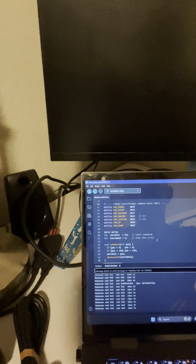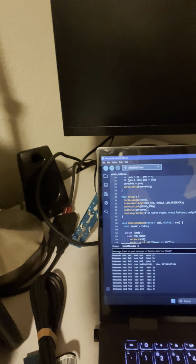And then I proceeded to define the keys that you press on the remote here so that you can easily understand how they switch and how we maneuver them, as well as some simple systems here to make sure it moves 90 degrees or 5 degrees depending on which button is pressed, which makes sense. Other than that, I have my setup for the servo here for positions, base position basically when it turns on, so that's not a problem. Then I have my setup here where I name my pins, which is pretty straightforward, as well as a print line here so that it's a little easier to read at the very end.